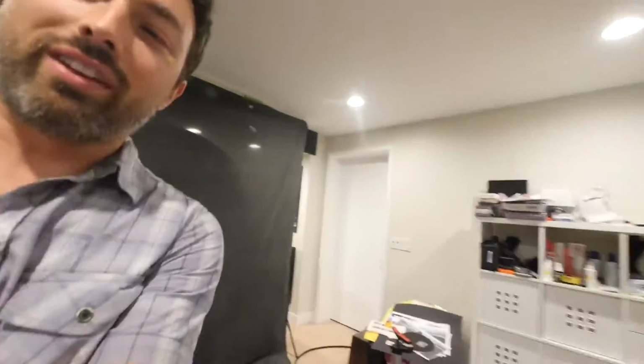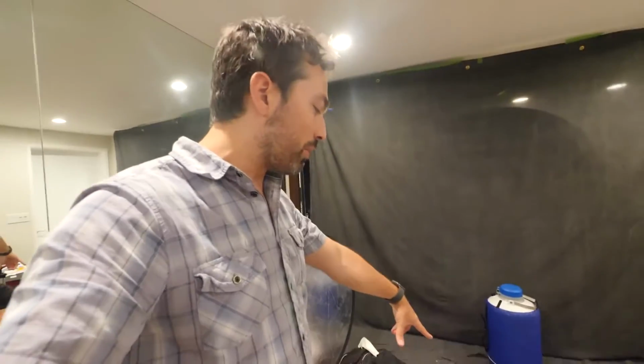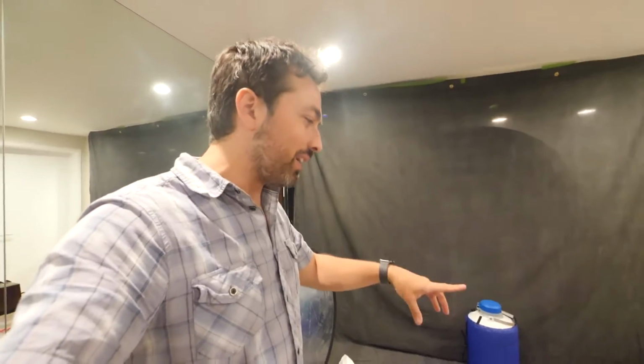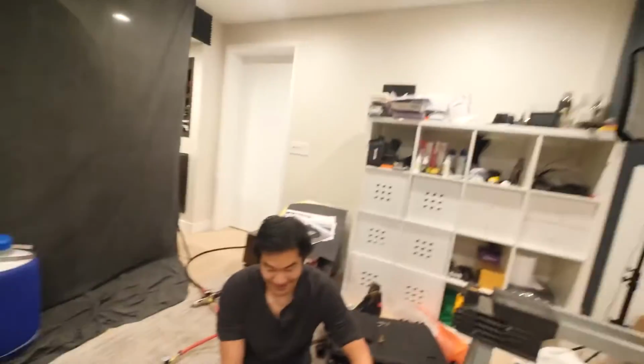I don't think this went very well because that was the first filling of the tank, so we weren't at high pressure going through the membrane. 95% nitrogen. So this meter measures oxygen. We're looking for a number less than 5%, which I suspect we will not see.